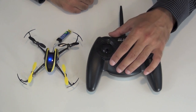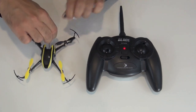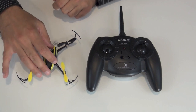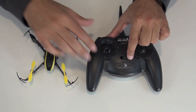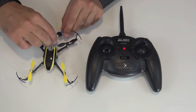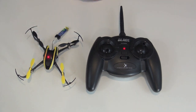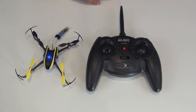So the next time you want to fly the model, just unplug it and turn it off. The one thing you want to make sure is that it's on a level surface so that the SAFE technology activates normally. You would turn on the transmitter first, then plug in the model. A flashing red light means it's initializing, and it should turn to a solid blue light — ready to go. You don't want to pick up the model and twist or turn it while it is initializing, because that will interfere with the SAFE technology.